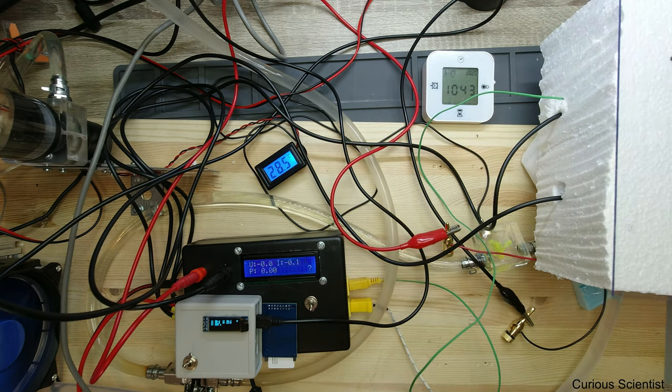There is another line on this screen — that is the elapsed seconds from the startup of the device, or from the starting of the experiment. It will go back to zero when I start logging on the SD card. We also have a watch here to give us some indication about the elapsed time. From the last experiment, when I was measuring the unloaded performance of this TEC12708, I concluded that the minimum temperature was below minus 25 degrees Celsius, and this was realized at 5.25 amperes.